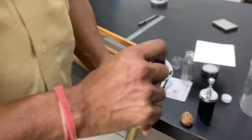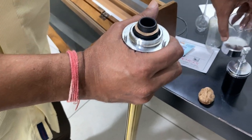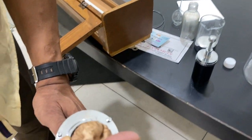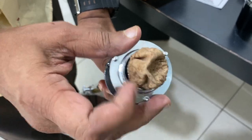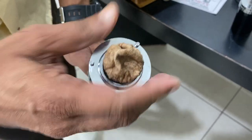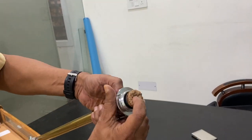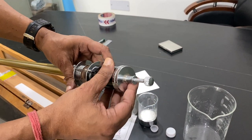Then after this, I fill this outer chamber also with the mercury. Again filling with this — I will show you the actual demonstration, it is only for guiding you. And then close this chamber tight. And then push this — and then slowly you have to push it inside. Then the mercury will be on the bottom — you can feel that the mercury is coming here. Then you will close this section.